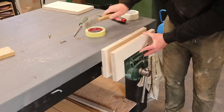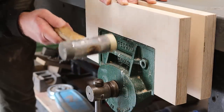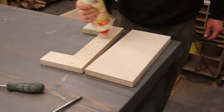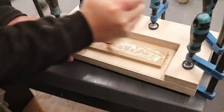I want this front piece to be flush with the front of the vice, so I get it carefully positioned and then measure the offset from the other side, which looks to be around 9mm. I'm going to get these two pieces laminated together and then use a 9mm scrap of MDF glued in place just as a spacer to give me that offset.